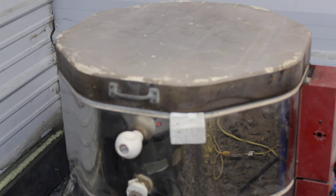Right now I have a mold inside the kiln getting ready to cast a Pyrex blank — there's no glass in it yet. What we need to do is fire it and degas the mold: get all the residual air that might be trapped in the construction of the mold to escape. You can see some kiln plugs and a little white block propping the lid open just a little bit.